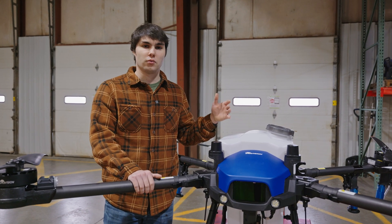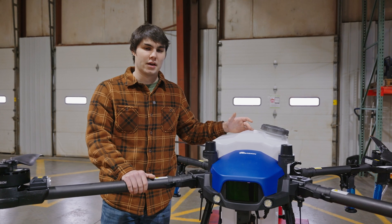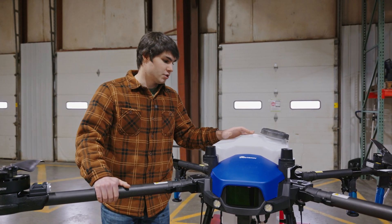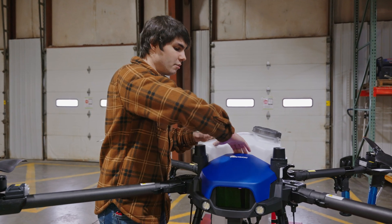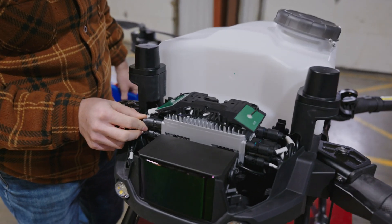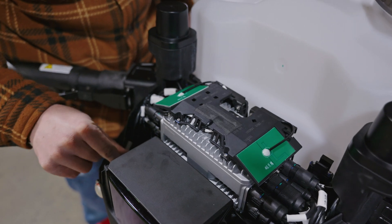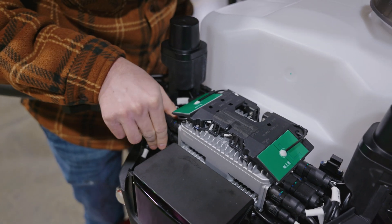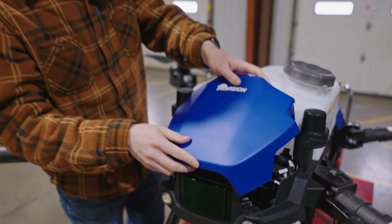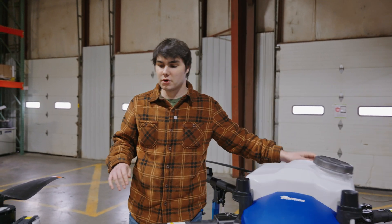So the first thing, we're going to check for rodent and water damage. Depending on where you store your device, that can allow them to come into contact with rodents or water. Just checking overall for water damage or for any rodent activity under the covers is important. You're going to want to check the electrical connections and make sure that nothing's been nibbled on and there's no signs of fecal matter or anything like that in the covers. After that's been checked, we can replace the covers and do the same thing on the rear of the drone.